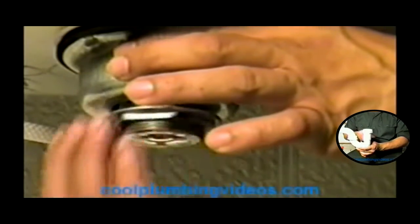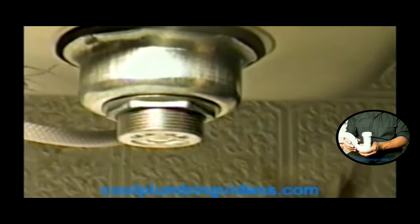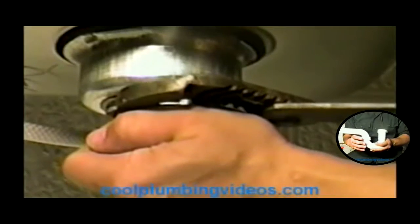If you have any knowledge of plumbing, you'll see that this particular basket strainer is the best way to go — nice, easy, quick to hook up. Now we've got that nice and snug with our hand. Let's get our pliers to get a better grip so we can tighten it up real tight, because we don't want anything to leak. Now as we're tightening this, putty up on top is squishing down in there so we're getting a nice tight, tight, tight seal, so we shouldn't have any problems with any water.